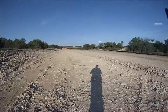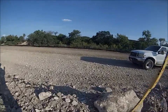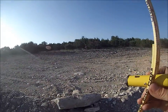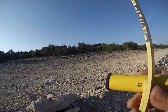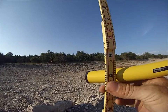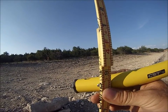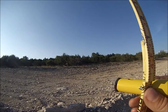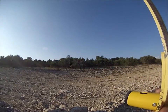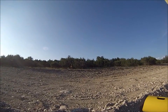All I did was come out so many paces from my hub. I knew what 335 was over there, and I was shooting at various heights to make sure that this right here is lower than the toe over there — to make sure that I have fall.